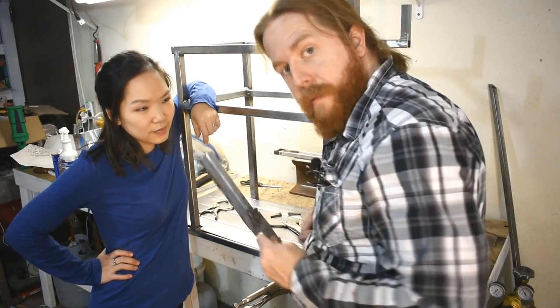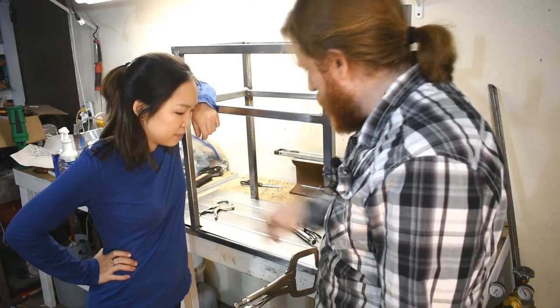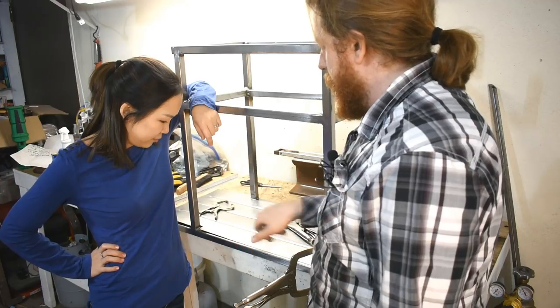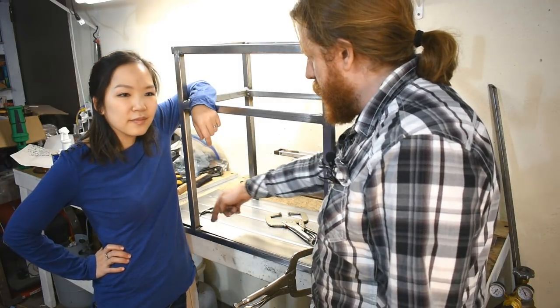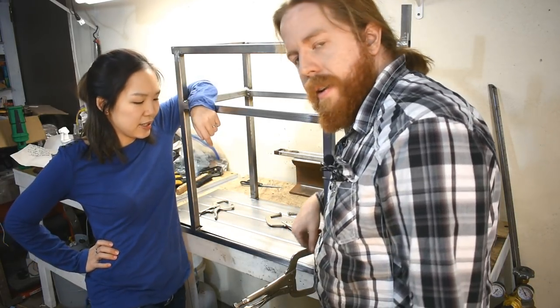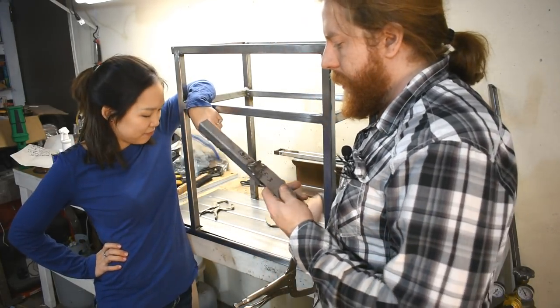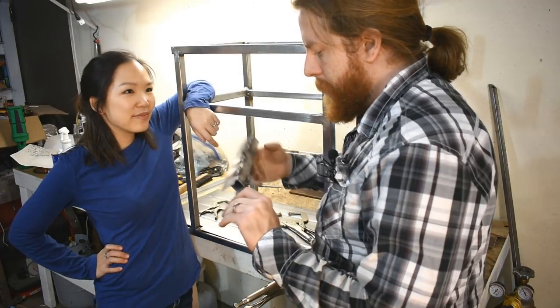So we're going to start, but we're going to skip. We're just going to do like an inch on the corners. And then we're going to hit, you know, in the middle. And then maybe in the middle of that. So we'll just have a few single inches of weld instead of a super long bead. What is that technique called? Skip welding? Skip welding. According to Google. Yep. And I can say it with confidence because Google makes me appear smarter than I am.